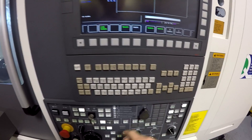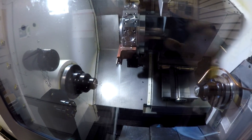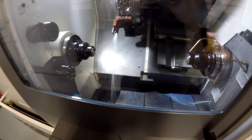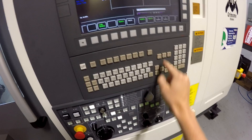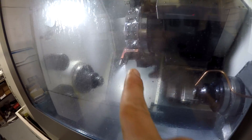Let's see if this works with no errors — M7. There we go, this is low pressure coolant, the standard coolant pump. You can see it comes out there too to wash the chips off. As the applications guys told me, you can pee harder than that. So that's low pressure coolant. Reset — high pressure coolant is M8. A little bit different — 300 PSI. Obviously that one needs to be aimed better at the tip of the tool.